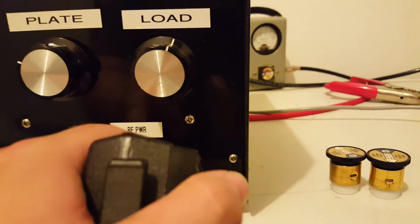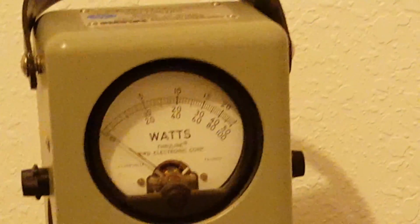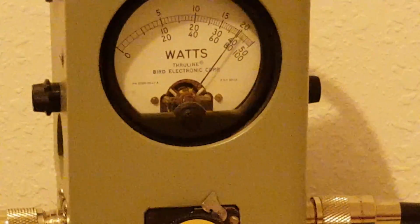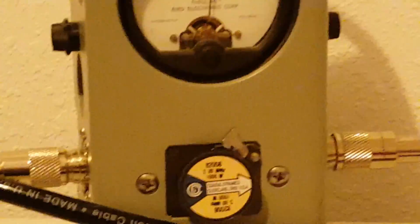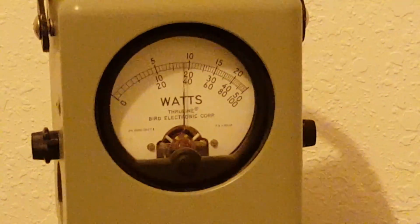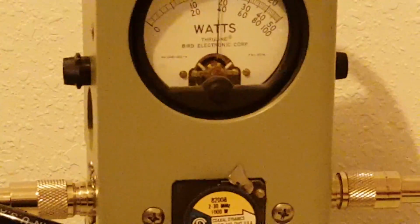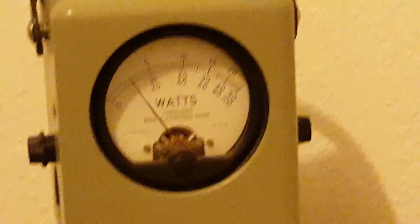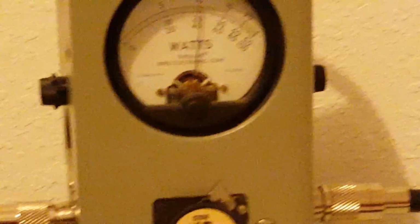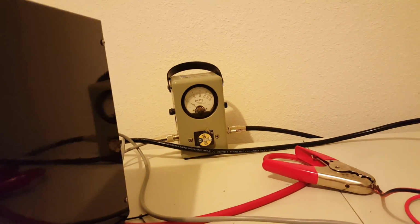We'll back her on down here again. Go back to all the way down. Audio or radio, 1, 2, 3. Audio, 1, 2, 3, and we're back up to 800. Like I said, increase it. That's the bias at about 9 o'clock. Audio, 1, 2, 3, and that's about 11 o'clock. And from 11 o'clock forward, you're looking at about 500 watts peak output.